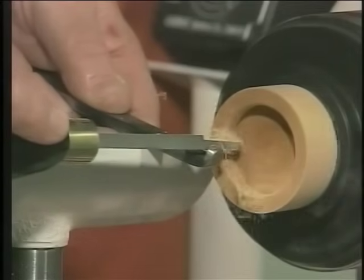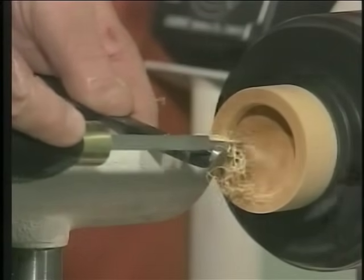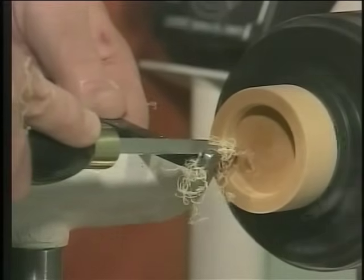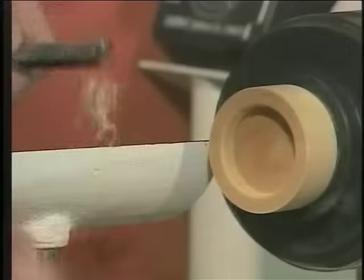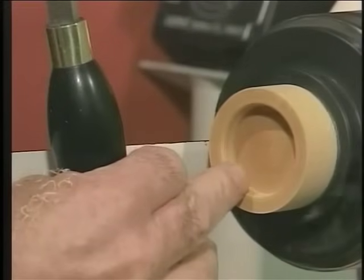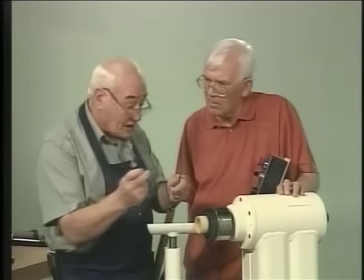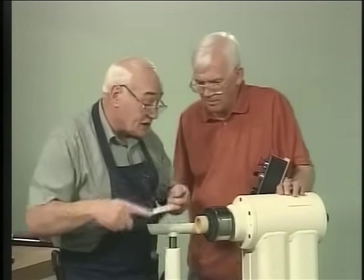Now, as I go down, I'm adding another thread each time, look. See how there's one more thread being added each time? And now what I've done, I've reached all the way through, so the thread is now cut on a taper. But now I can cut with the lead tooth, because it's got a track to follow. But without that track, the chaser would stop dead.